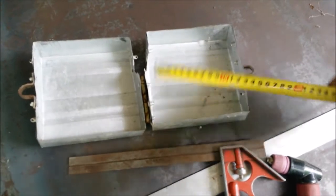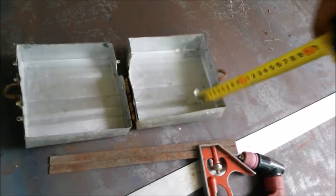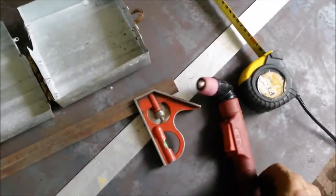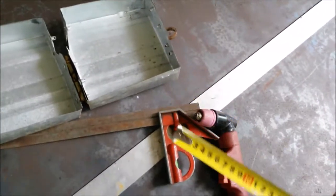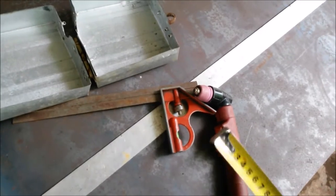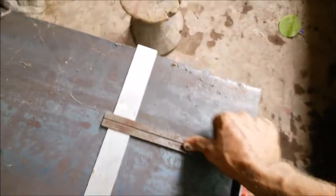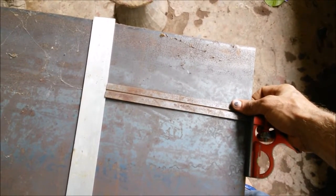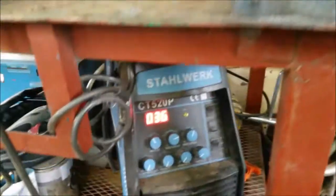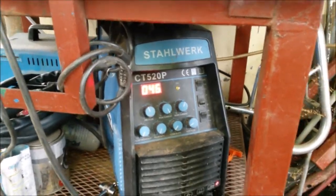For this inner box, it looks like 15cm by 15cm we'll use, with a 5cm height, so that makes 25cm wide. The plasma cutter tip is 7mm wide, so 25cm plus half of 7mm with the 1mm kerf — set that to 25.4. So now we'll just go down here and put this at 25.4, clip the one end. This is just a thin 1.2mm plate.